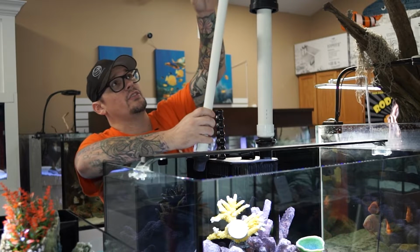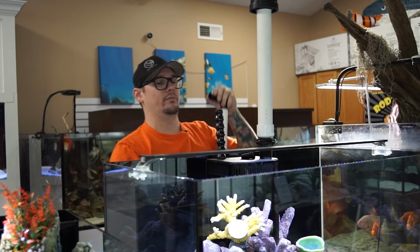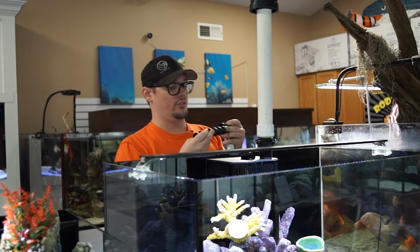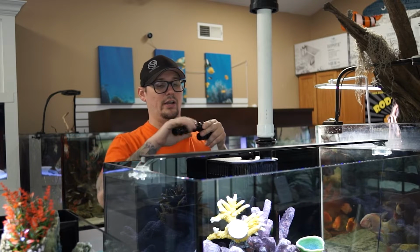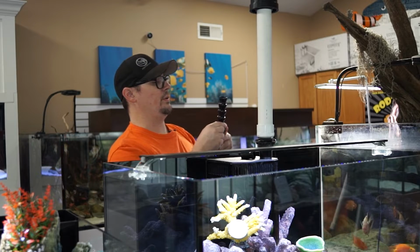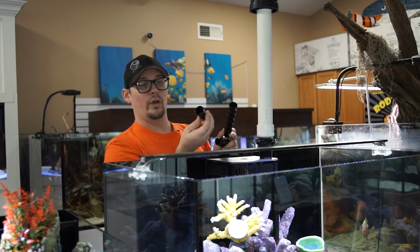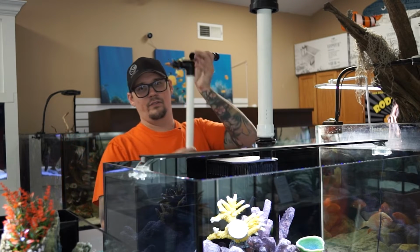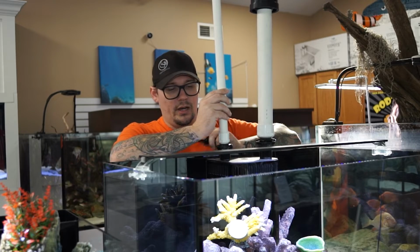Then you're gonna take this, you can Teflon tape this, bring it into here. One of the things I like to change for me personally is I always worry about back pressure, backflow. This is elongated. I don't like when they're this long. I'll actually try to make this as short as I can. So I'd only probably make this 3 links with the return spout to it. That's it. Reason being is I always want to make sure nothing comes back. Now when you're hard plumbing especially, you want to use a check valve, but chances are a check valve could fail, so you should make it so you don't need a check valve. Boom, boom, very simple. And then you just plumb right from the bottom all the way up.